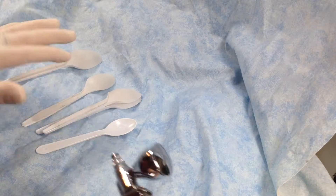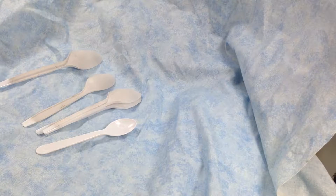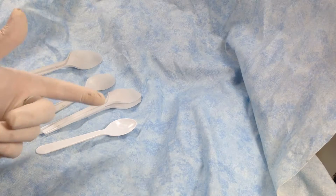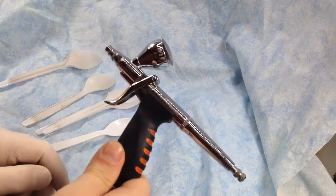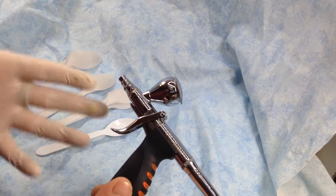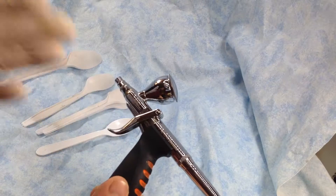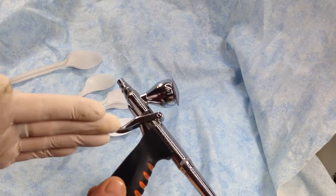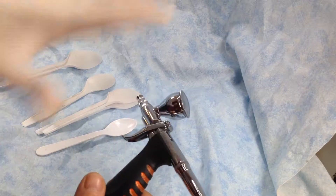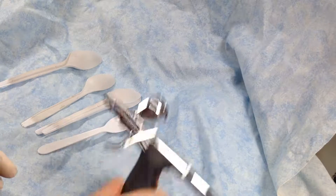If you're wondering about this cloth in the background — I'm not going to be using my spray booth because it's easier to film here on my workbench. I'll put this cloth up to make sure I don't paint my entire workbench. I am going to have the extractor fan on, so it'll be a bit noisy. I'm not going to wear a mask because I need to be able to talk to you. However — don't you do that. Whenever you are spraying any kind of paint, varnish, or anything like that, wear a respirator because you're going to inhale it. All the paints in the world contain potentially toxic chemicals. If you can use a spray booth, use a spray booth.